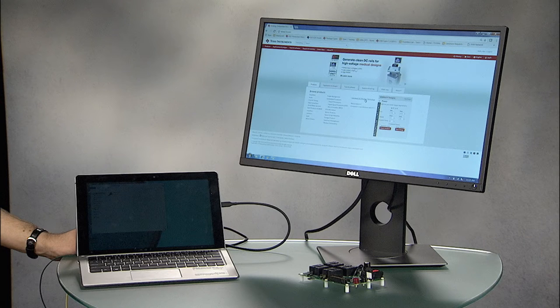I have here a laptop that I'm using to transmit video over USB Type-C between my laptop and my monitor. Without protection, if a short were to occur between the 20-volt VBUS and the CC or SBU pins right now, the USB controller would be destroyed.